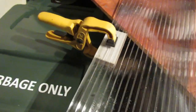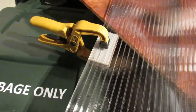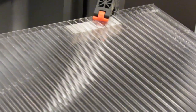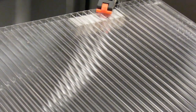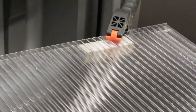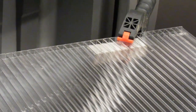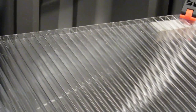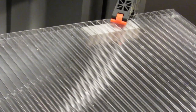Now when you're putting it on, you see I have a block here, there's a block back there, and there's a block back over here that mark the edges of the inside of where the frame is. That makes it so I can place this right down on top of the caulk without smearing it around, and then clamp the edges down on the panels.